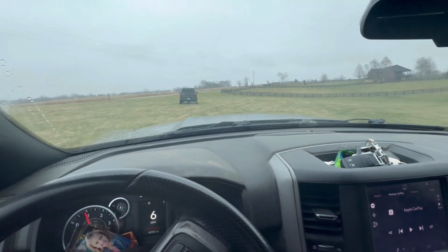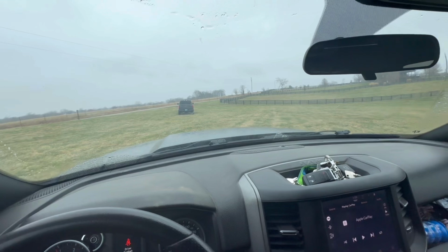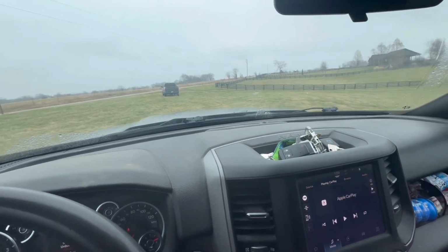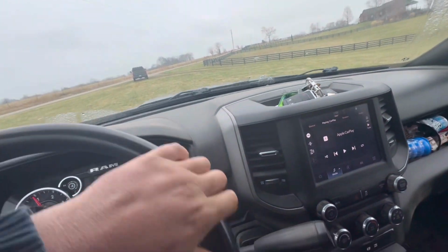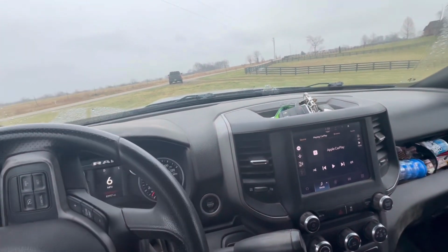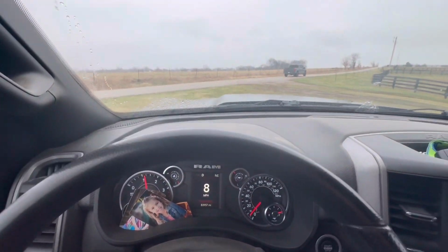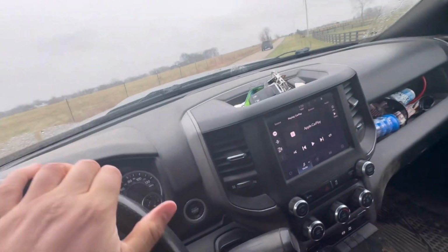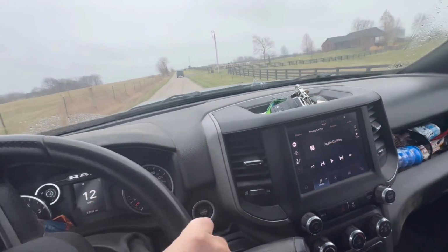So it started raining just enough to make everything stick, and I think we're gonna call it a day and be back Saturday, blade off whatever wetness is there so we can pack the core trench a little bit better. You just don't want to try to pack it too wet. The roller's not really working, stuff sticking together. It's just not a good idea, so we'll be back tomorrow.